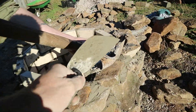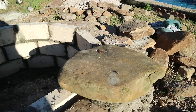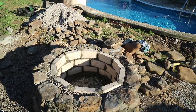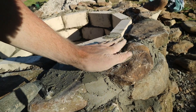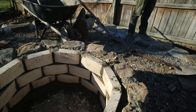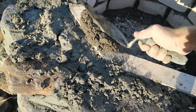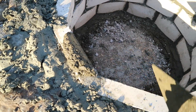Ashton is filling back in right there. I'm coming back through and making sure it's level with the top of these bricks. These last rocks — the flat ones that come along the top — they finish it off, just a nice finished touch where you can kind of sit on this or stand on it. Whoa, look at that thing, we are making some serious progress. It's going nice and level across there. We have this fire clay mortar and I'm going to use it on the top here, clean all this off and slap that right there, because that really needs to be able to resist the heat — there's going to be quite a bit of heat climbing up through here.